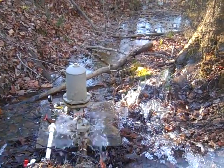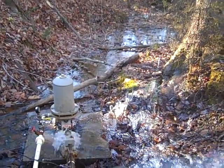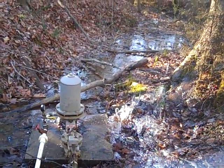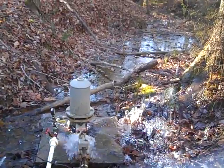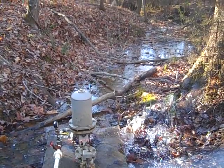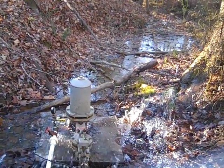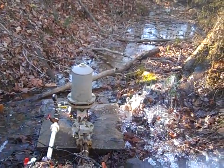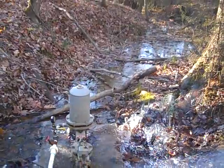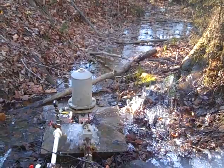But if it stops for any reason in the night, you're going to have busted pipes. Make sure you know how to keep it adjusted and that it's been running consistently before you do this test. Don't start it up and walk away — make sure you've got a few hours of it running. They're finicky sometimes, so make sure your pressures and air are out of the line and it's functioning right. Otherwise, drain it — just shut a couple valves off and drain the lines down. But you can see the benefit: a tank full of water with no ice on a cold morning.